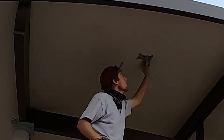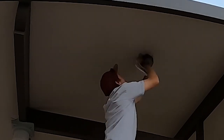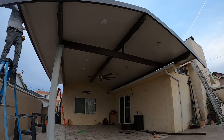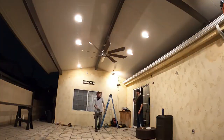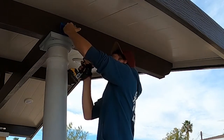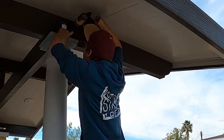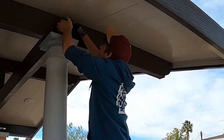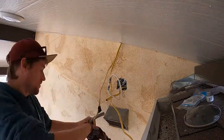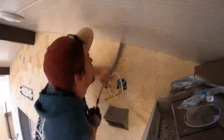Here's a close-up of me doing the electrical, and then we're finishing up the wrap kit on that side. I hot-wired the lights to work that night so we could finish up some stuff. Here I'm doing a GFI on top of this column for some rope lighting that's going to be going around the patio. You've got to make sure you have an old-construction box and a proper cover for that. This is me hooking up the lights, the plug, and the fan all at once — this is the main junction for all of that.